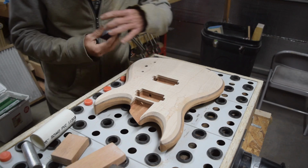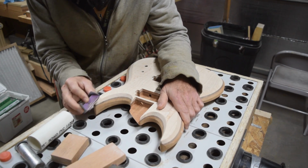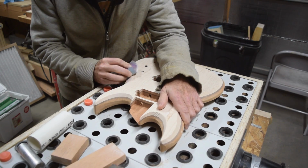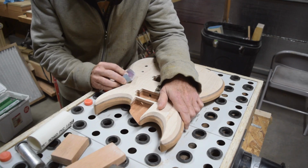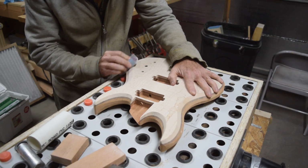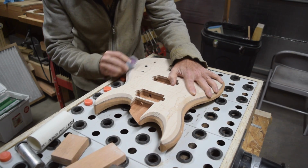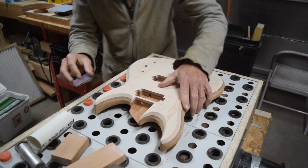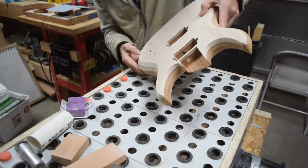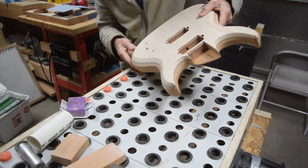Even though I have a bunch of power sanding machines in my workshop, I still have to do quite a bit of hand sanding in order to get the surface absolutely perfect. It also helps to have really good lighting that will cast both light and shadow across the wood. It's a process that allows you to see any flaws, not only as far as scratches or tool marks, but also where corners and edges might not be perfectly formed.